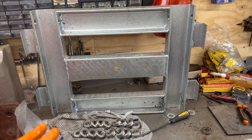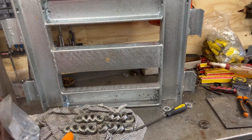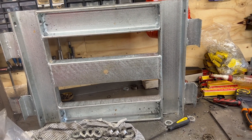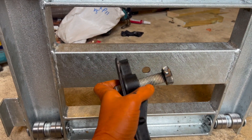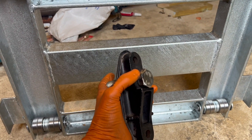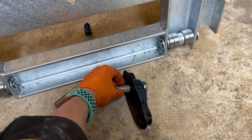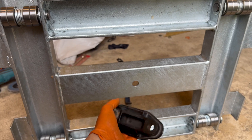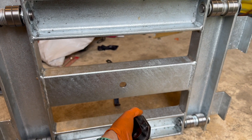I've got all eight holes drilled including the middle one for the hoist. We're going to fit four bearings in each one — I've got some washers and some silver steel shafts turned down with a circlip groove on them. I've got all four sets of bearings on now. The part that goes into the top of the hoist has a little shoulder on it, and I've tack-welded one side of the bolt to stop it from spinning. Then I'm going to drill a hole for a split pin so it can never come off — safety first, but it should be good.